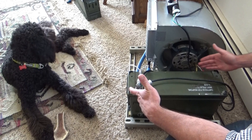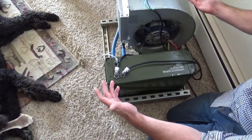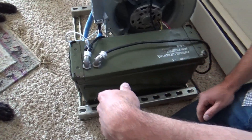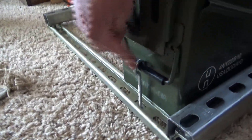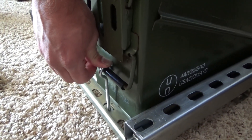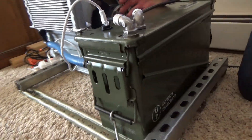In the original build video, we just left the can and the fan connected by the hoses, but you can add any kind of frame you want. In this case, I used some Unistrut to build a nice sturdy frame. You can also hang this from the ceiling if need be — all you need is some hooks. You can use the handles to hold the can tightly up against the frame, and then just bolt your fan onto whatever works for you: a piece of plywood, scrap metal, 2x4s — anything of the sort will work.